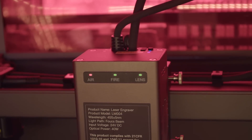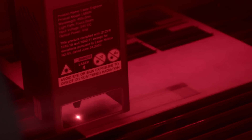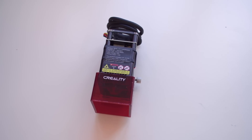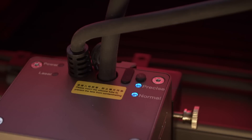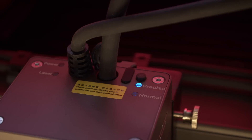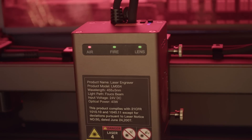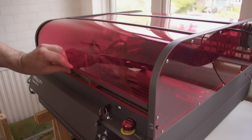Finally, I just want to take a look at the laser module. I think these are the same modules as before, but this time Creality have actually sent me the 40-watt version rather than the 22-watt version. Now obviously that's a more powerful laser, but the actual line it creates will be a little bit thicker as a result. So with this machine, Creality actually send out a second 1.6-watt module too, and you can use that for really fine engraving — and that comes with all of the 40-watt versions as standard. You may notice on top of the 40-watt laser module there's a button with two LEDs labelled Precise and Normal. If I press down this button, you'll see that Normal has gone out, and so in Precise mode this 40-watt laser is now running as a 22-watt laser, so that we can get slightly finer lines while still being able to cut through thin material. This means that with the 40-watt version you're actually getting three different lasers which will cover you for all kinds of projects — it really is the best of all worlds.